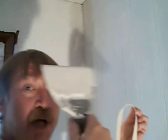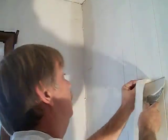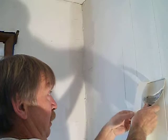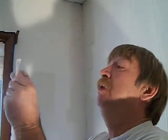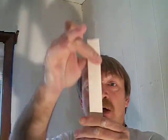What you do is take the trowel, line it up, get it level, and just like that — perfect edge for this application. Another thing that's really neat about this paper tape is this is what makes it easy: this is made for this, so you bend it in half like this, and then just go down it, all the way down.